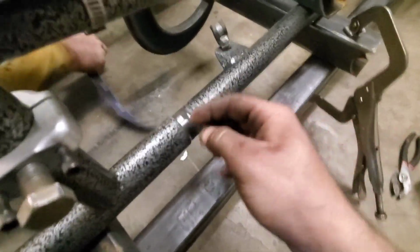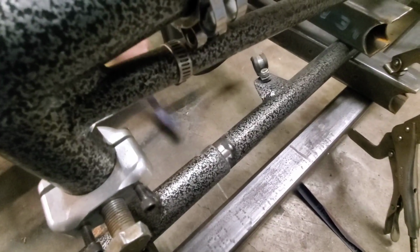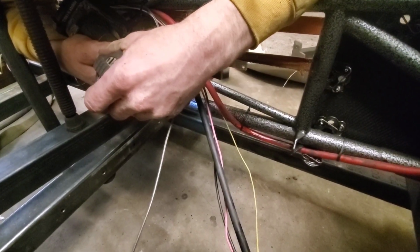All right, now we're just working on cleaning up the steel around here so we can go ahead and weld them. I think we've pretty well measured this thing out and got it as straight as it's going to get. And see what happens. Before we weld this, we're going to drill two pinholes, one on that side and one on this side, just to be sure.